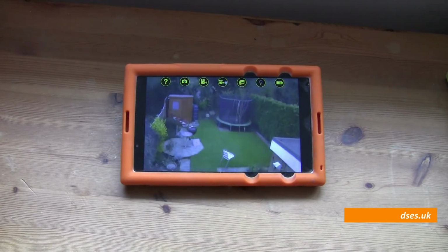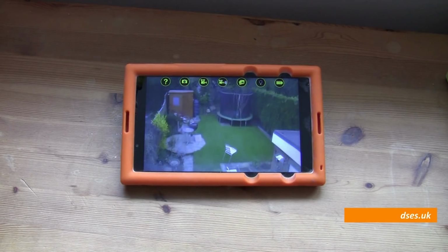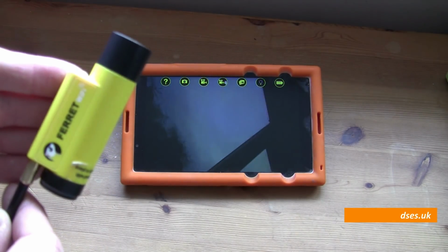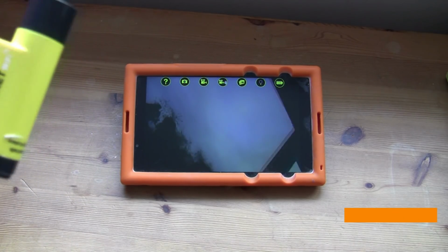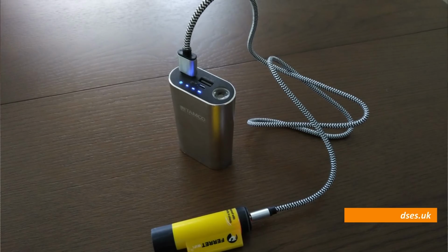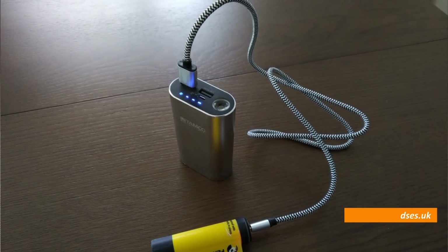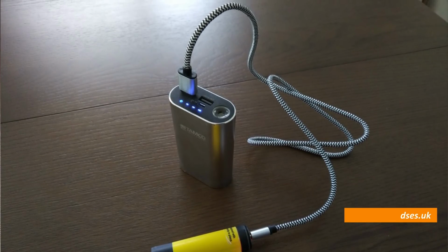We also have a battery indicator on there. What happens when you press that? Well, nothing, it seems. Although that will obviously show you when there is a low battery warning, which I have seen out on site. And that's one thing to mention, actually. Obviously, it is a small form factor. It is doing a lot, so you can't expect miracles with the battery life. Therefore, if you're likely to be using it in anger on a site, as we've just been, you can deplete the battery fairly speedily, and you might need to have some means of boosting that charge. We carry a USB power pack around. I've got one in my toolbox that I carry around, which is just the job for this sort of thing. So you might need to think about that if you're going to be using it.